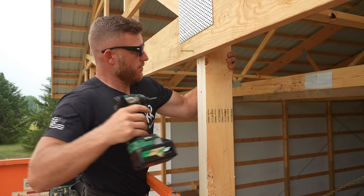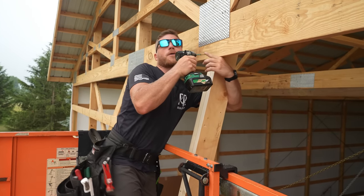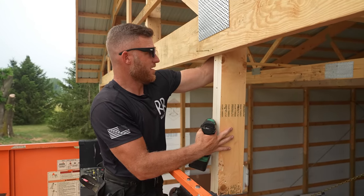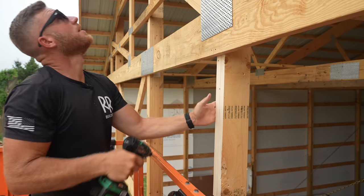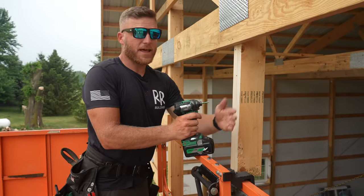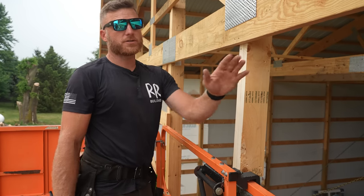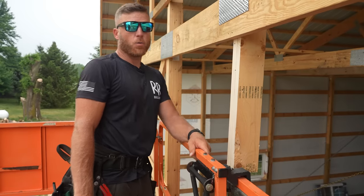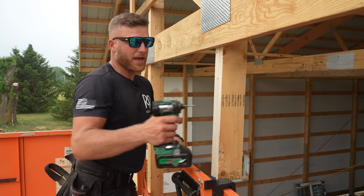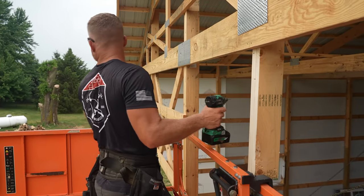I'm an idiot — I put a screw in the center and it doesn't work when you've got two boards. Okay, that's better. Now I'm going to get this all fastened up. This is what our header is going to attach to — it's going to come from this post to this guy to that guy. I don't know the exact height location so I'm going to have to figure that out and get it cut off. We'll get all these installed and then snap a line from this end to that end where we want it, based off those posts where we have marks shot with a laser, to ensure the header is level. I can hear the thunder — we might get rained out.